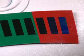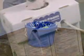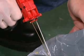First, check the temperature sensing strip. B-rich foam may be an indication that the chemicals are too warm. If the strip indicates red or near red, cool the kit until the strip indicates green. Shake the tanks for a minute or two, check the temperature strip again, and do another test shot.